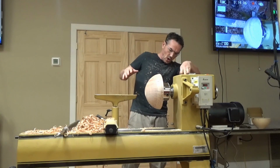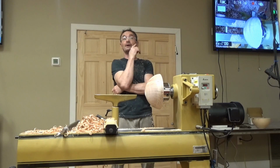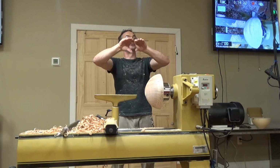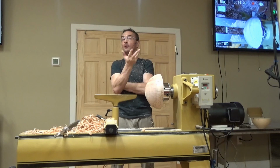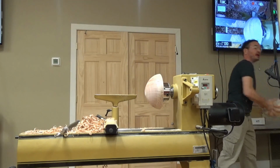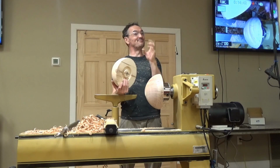Stuart, when they compressed that wood, did it get wider or did they keep it from getting wider? They didn't actually support the sides. Great question. No, they didn't need to support the sides. Now, it would get a fraction wider, maybe an eighth. But the way they compressed it, it didn't sandwich out like if you took putty, it would just keep squeezing out. No, it just kept getting smaller. And it was done over about 12 to 14 hours, without heat or anything, and the wood was relatively dry. Now, not all woods will compress quite that clean, but the hornbeam did. Did it stay compressed? It would stay compressed unless you threw it in a bucket of water. Then it would pop out overnight.